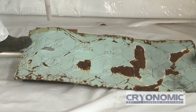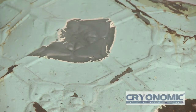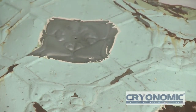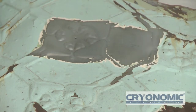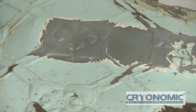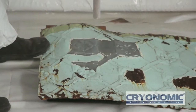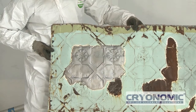Old pressed metal ceilings are thin and very soft. Chemical stripping is time consuming, laborious and particularly difficult when working underneath the surface. Initial coats of stripper tend to leave remnant material in the detail of the pattern. The surface also requires washing and pH neutralising after stripping. Again, at very low pressures, CryoPrep can use fine conventional grit media to break open the coating and the dry ice lifts the coating away from the tin without damage or distortion.